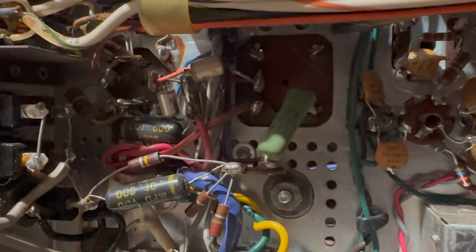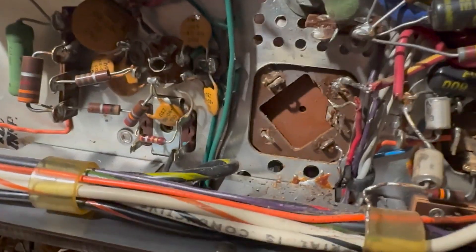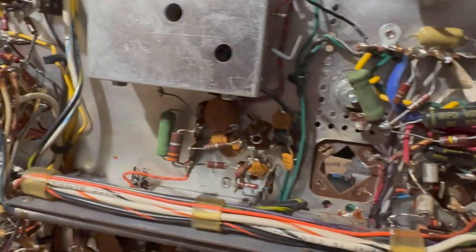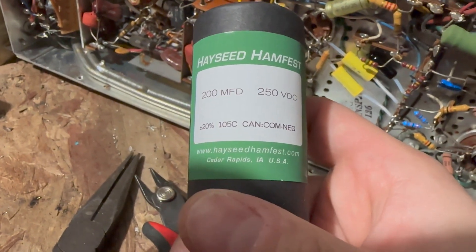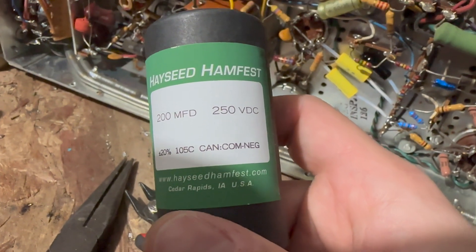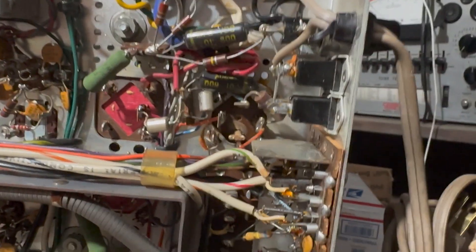We have these two down here. I'm going to probably save the worst for last. I'm getting this other can out — it's a little difficult. It's most of the way out, just got to wiggle it — got it. This one doesn't even have a label. 200 to 250, so we'll change that. Here's the new one — you can see how it's insulated. The power supply is wired so that the negative of this goes to the positive of the other 250 or 200 microfarad in the other can. We've got the second capacitor in, and now we just have the last one, which is very tight.